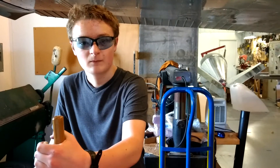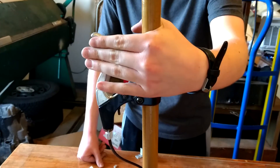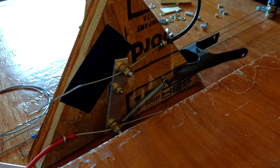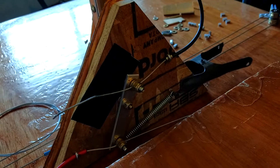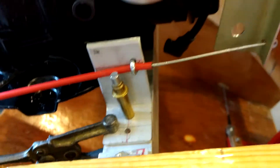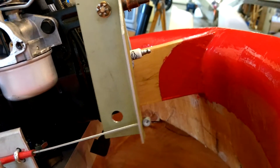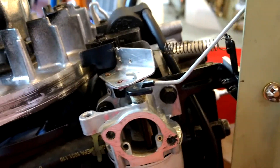This is our latest hovercraft throttle mechanism test. Hand grip — cable comes down to here, to this part of the mechanism. That spring pulls it to basically idle. Cable is fixed to the engine mount. You can see at wide open throttle, the barrel sticks out a little bit. There's our pivot point, and then there's our mechanism to the carburetor.